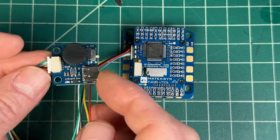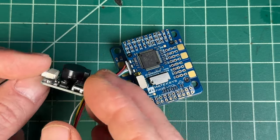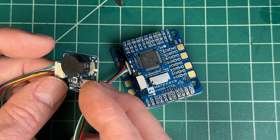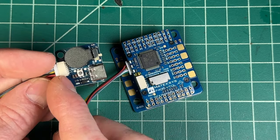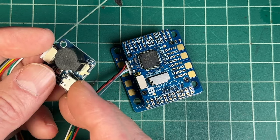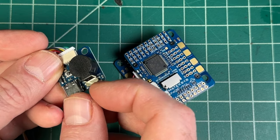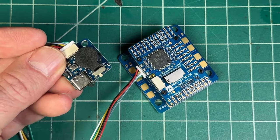This is a nice little PCB breakout that has a few extra options. We have a buzzer — not an external battery buzzer, which I always recommend for these types of builds, but it will act as a buzzer. When this plugs in on this side, it also gives you access to the USB port. It has a boot button and also an on/off switch. So if you're working in iNav and the beeper won't stop beeping, you can reach over and turn off your beeper — just don't forget to turn it back on when you fly.